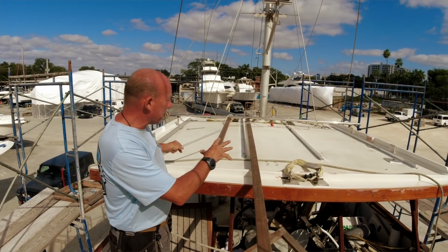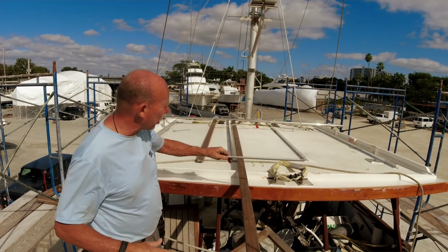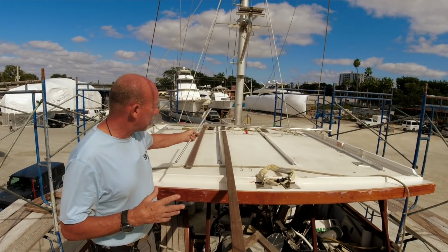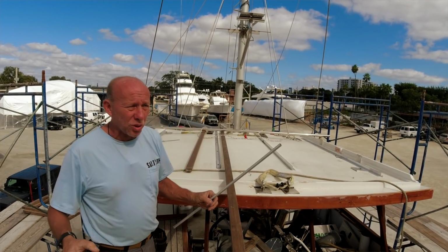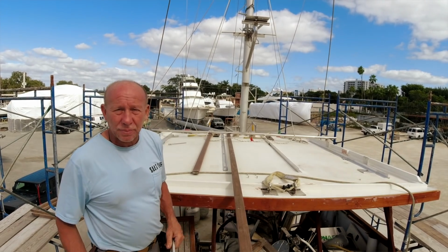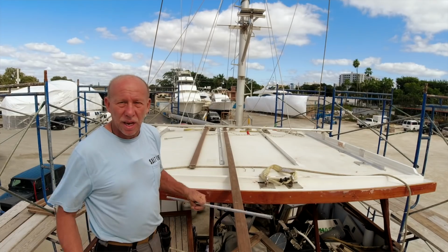At the same time, this becomes the water collection location. All of the rainwater is on a 10-foot by 12-foot top that runs to the back, and there are 2 downspouts, so it will filter that water. The first 30 minutes we won't collect, but then it'll go into an additional tank for washing, cleaning, and free water from the boat.